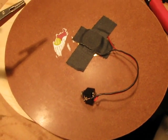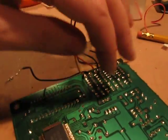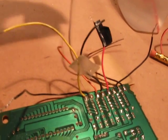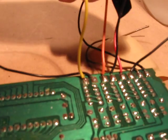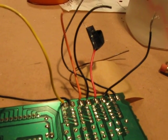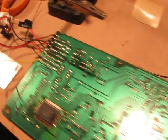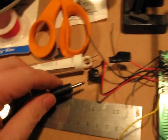To make this work with this cable setup I'm doing, I need to fiddle with the brain board. We have down here the bus where all the drums come in. I've obviously been testing various ones here, just twisting them together. In the interest of keeping things clear later, the orange and black leads here are the ones I'm going to use. I'm going to be desoldering down here and putting in new leads so that I have some elbow room, because these leads are pretty short. We've got the brain board, we've attached a mini jack, but this thing's not screwed together yet.